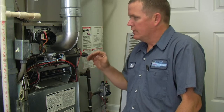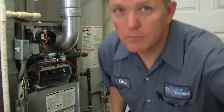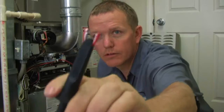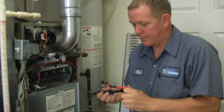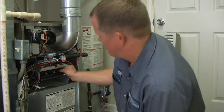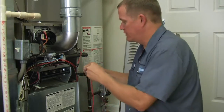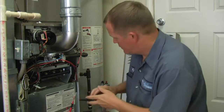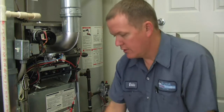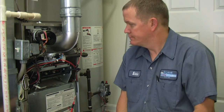We're going to go ahead and check it. I've got to turn the furnace on — it's going to take a few seconds for it to start up with that delay. I'll use one of these little alligator type clips, put it on the test lead. We'll go ahead and unplug the flame sensor. Pointy lead — stick it in here. Alligator clamp, clamp it onto the flame sensor itself. We're just going to wait for the furnace to start up and once it starts up I'll get back to you.